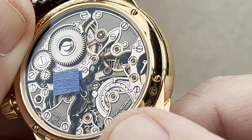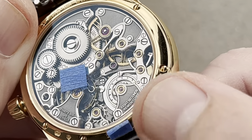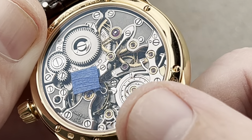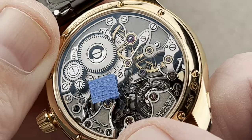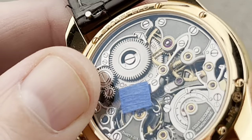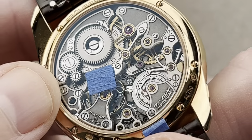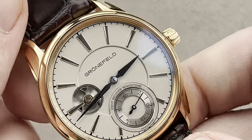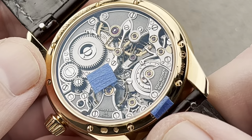You can see the mechanism — both the locking system and the wheel and tensioner that underpin the remontoire. The barrel, which has a 35-hour power reserve and stop works, will re-energize the remontoire every eight seconds. It's the remontoire spring that actually drives the escapement rather than the barrel directly. So for the 35 hours this watch is running, it maintains constant amplitude and thus can be regulated to keep excellent time. Look at all the black-polished steel on the back of this movement. Take a look at the solarization on the ratchet wheel atop the barrel, as well as the mirror well surrounding the binding screw. The stop works will stop the watch rather than allow it to keep bad time — it's easier to notice your watch is stopped than to notice it's losing seconds.